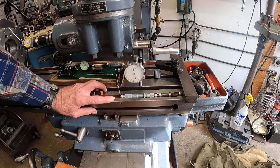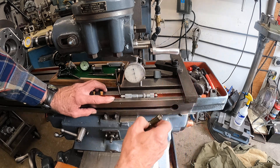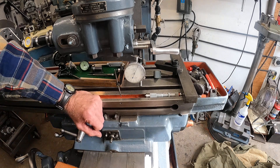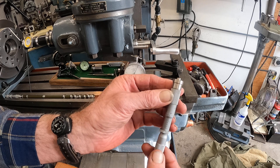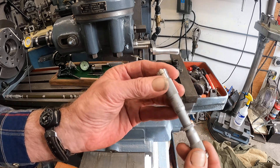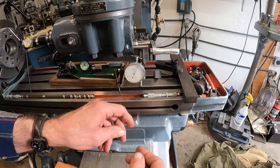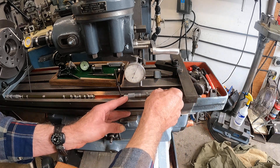And if you want to move this thing two inches, you can pull this one out, slide the micrometer head over like that — and that's two inches within ten-thousandths of an inch. Or you can dial in anything you want on this micrometer head. There are the ten-thousandths markings, and these things are made of the highest quality — they're really nice. We'll put the two-inch one back in there.